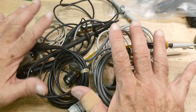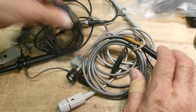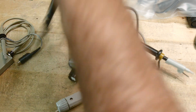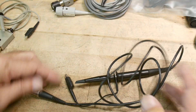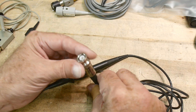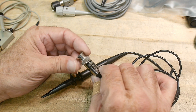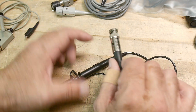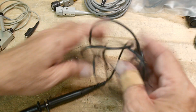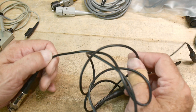Oscilloscope probes - this is for a beginner to educate you about oscilloscope probes, what they are and what they aren't. Oscilloscope probes are the thing that you plug into your oscilloscope; you usually use a BNC connector, and on the front of the oscilloscope is a connector. The connectors will look different on different oscilloscopes but most of the time it's a BNC. They have a cord that allows you to work somewhere else, and oscilloscope probes can come in different lengths.